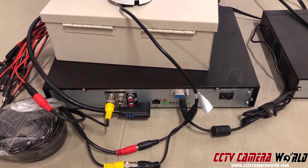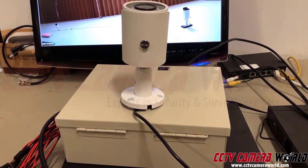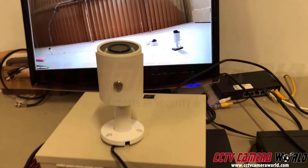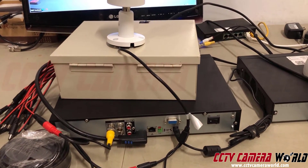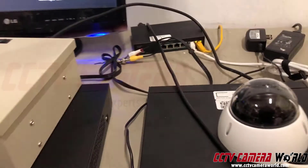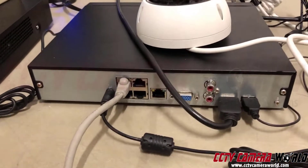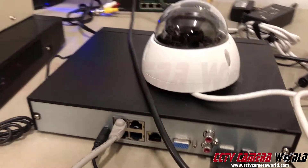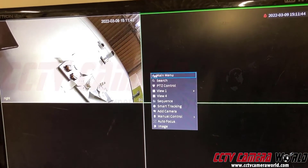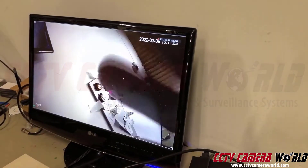Let me demonstrate. On the DVR side: coax cable, Siamese, power box, connected to the coax BNC camera — I've got video on the monitor with no internet connection. I'm waving my hand and you can see it. Now switching the video input — on the NVR, nothing is connected to the LAN port, no blinking lights, no internet connection, and I still get video from the IP camera in full screen. I'm waving my hand and you can see it in real time.